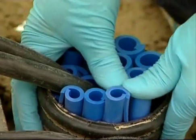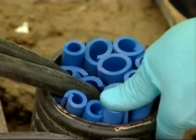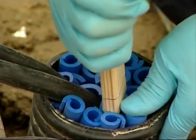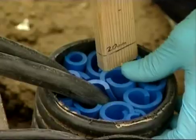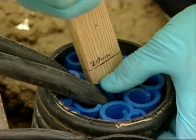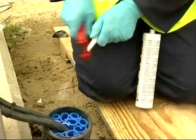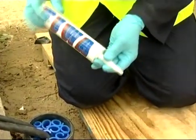Note how the RISE sleeves are inserted above the penetration, then pushed down together inside the penetration, preventing the sleeves from dropping. The sleeves are adjusted to give 20 millimeters of free space below the top of the penetration. This space is left to allow the application of the FIWA sealant.